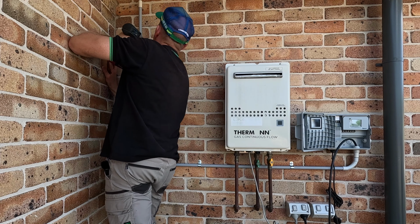So what we're gonna do now is pare back this black here and expose what they call the cores. In other words, there's a heap of little cables inside here. And each one of those is gonna marry up to one of these zones here. So this is, as I said before, one of these Pro HC controllers by Hunter. Now, this is only one of the smaller ones. It comes in a 6, a 12, and the one at home is a 24.